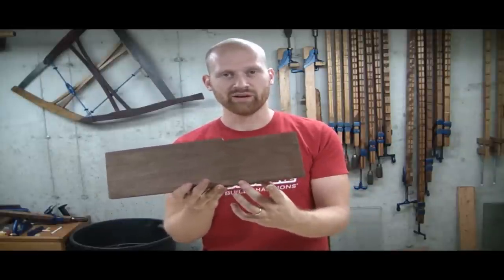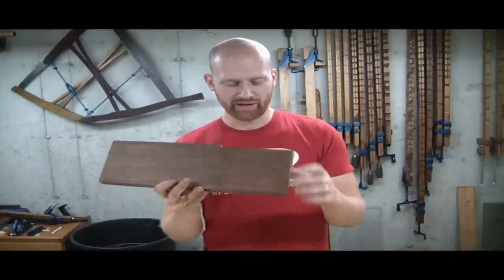Then I'll create a little bed to hold the chisel, and I'm going to do a little bit of blacksmithing — not real blacksmithing, but I'm basically going to take this chisel, heat it up with a propane torch, and bend it into shape. Once it has been bent into shape, I can turn it into a router. This board will then hold this chisel precisely a quarter inch down, or whatever depth I set it at, and route that out. So yeah, that's the project we're doing — follow along and we'll have some fun.